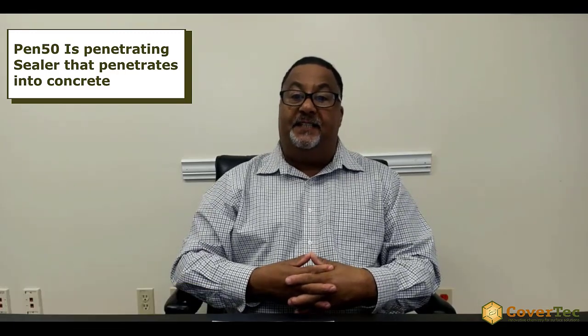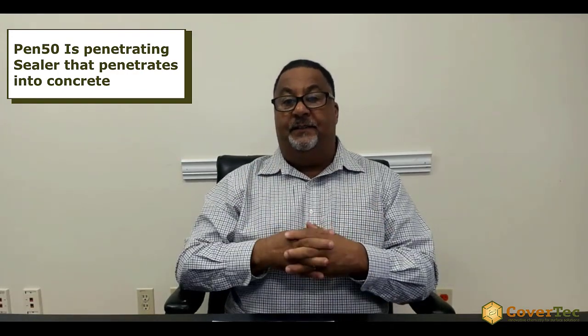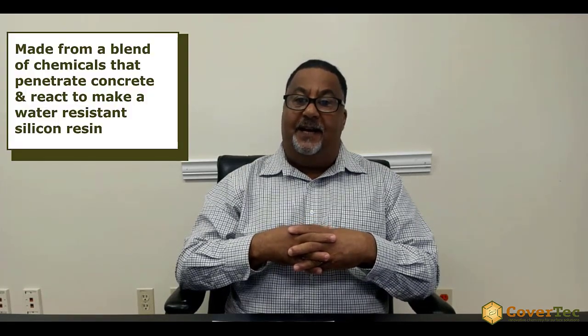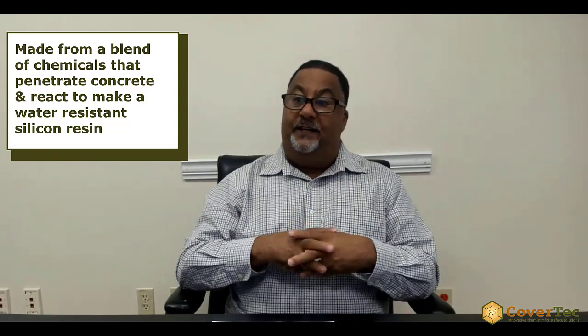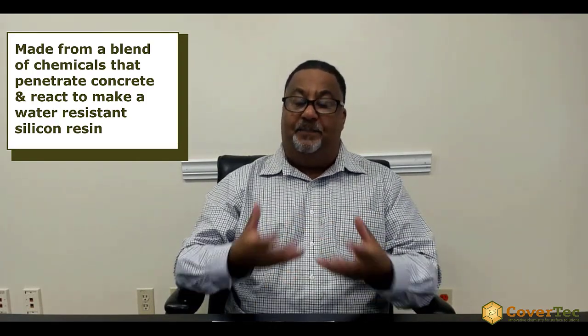So our Pen 50 sealer is a penetrating sealer. That means it penetrates into the surface, into the concrete or stone, without leaving a film on the surface, and it's very water resistant. It's made from a blend of silane and siloxanes that penetrate into the concrete and react and form a silicone resin that's highly water resistant, highly repellent.